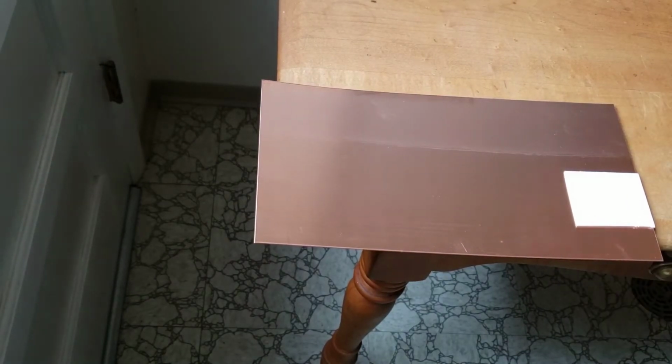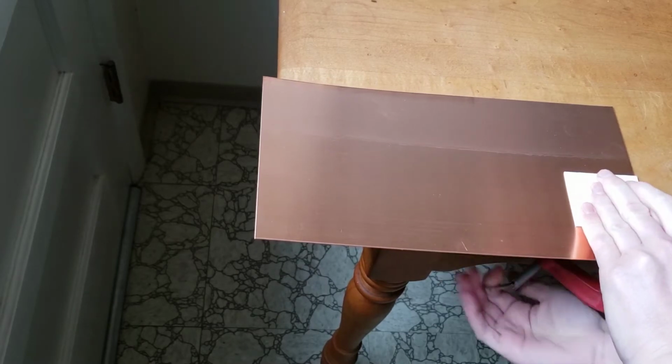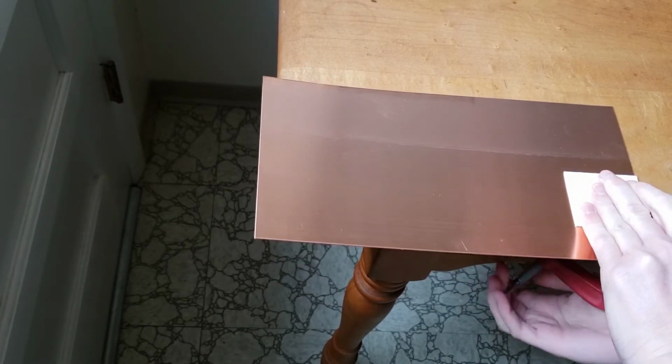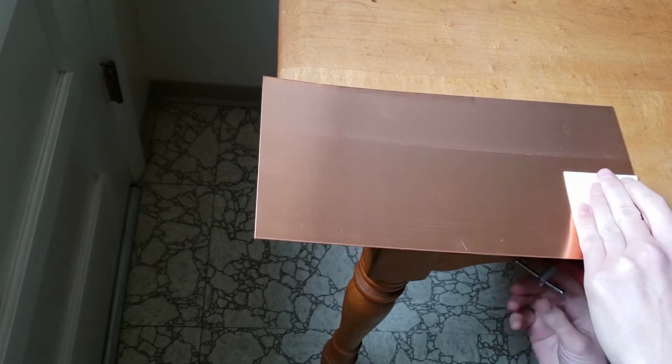This goes fastest if you can use a corner so that 2 sides overhang the table at once. This enables you to file 2 sides before needing to move the C-clamps. They will only need to stick out about an inch or so. If it overhangs too much, the plate will flex while filing.